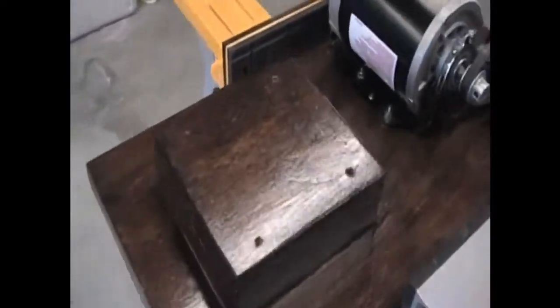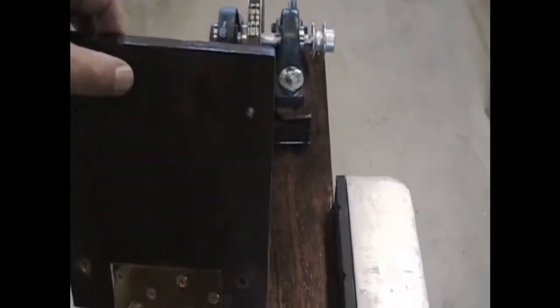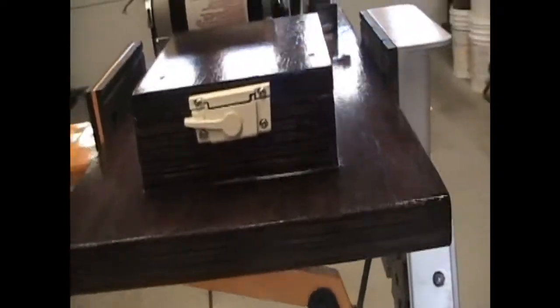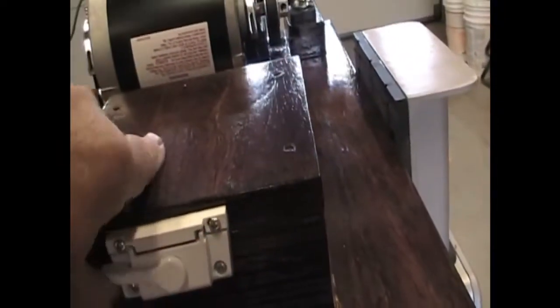Here's the fourth layer of plywood that is hinged with a four-inch hinge. The meat grinder itself will be bolted to this little door, with recesses drilled to make clearance for the bolts. To hold the door in place with the meat grinder attached, I bought a latch for a double-hung window. This opens it up, relieving pressure on the belt to take the grinder off, and also holds it securely in place. To remove it completely for cleaning, just pull out the pin and it comes right off.